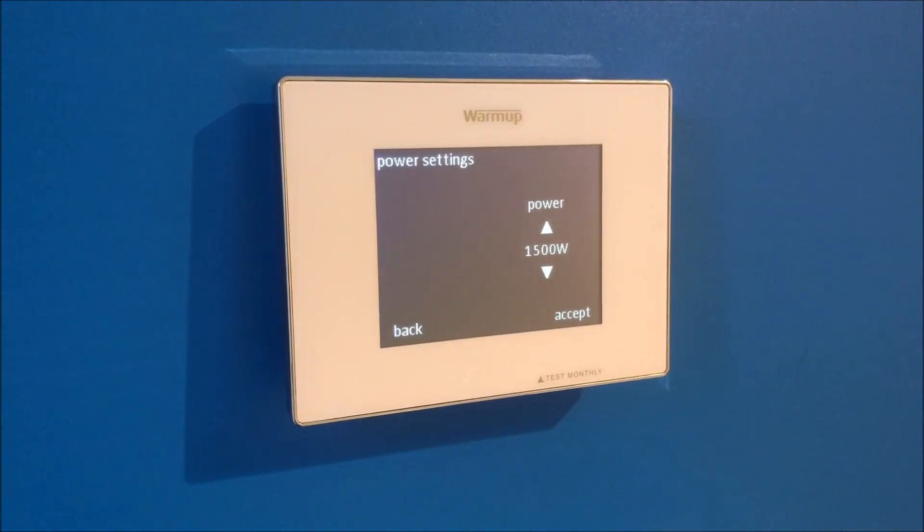Power settings is the total wattage connected to this thermostat. This will provide information on energy consumption, so if you'd like accurate information, it is important you put the proper wattage. The wattage of your heater is the last series of numbers in the heater model's number. If you do not have this information, check with your installer — you will want it for warranty registration purposes. If you are unsure and would like to proceed for now, go ahead and put in 1000 as a placeholder and press accept.